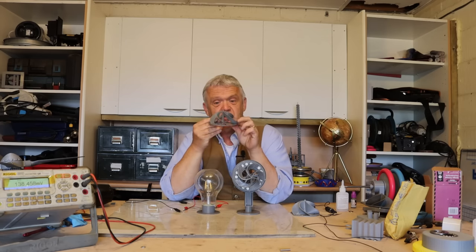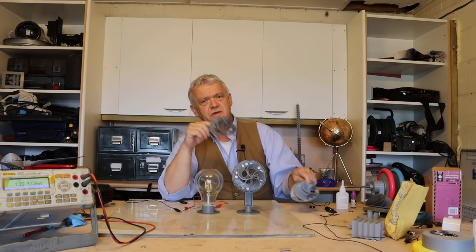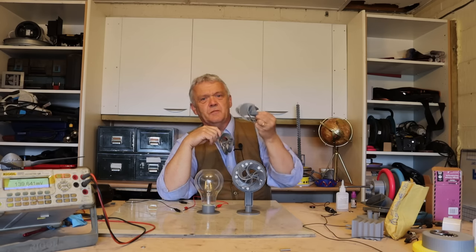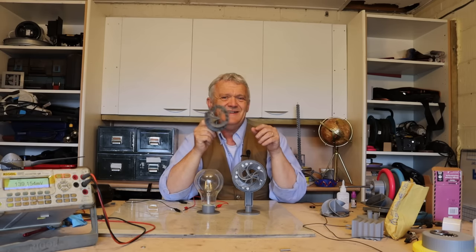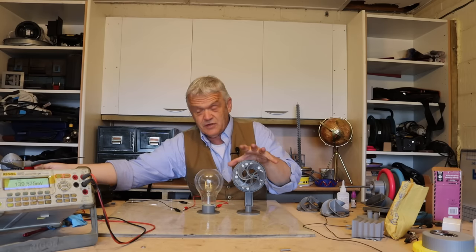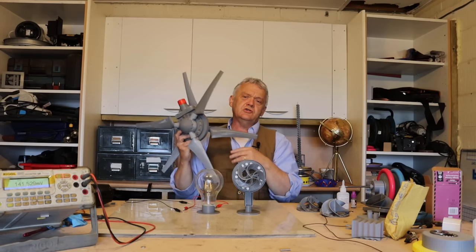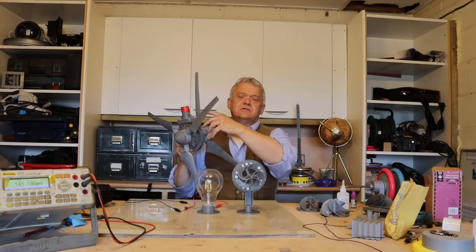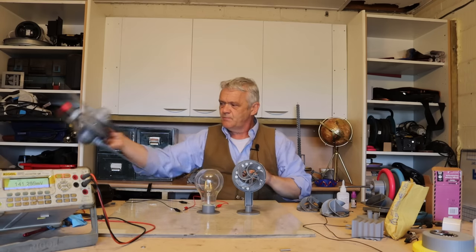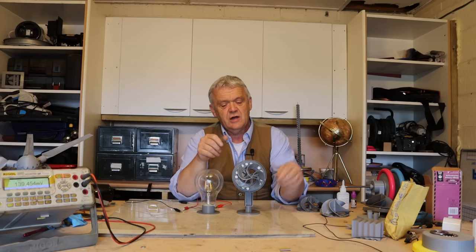What I've done is basically hollowed out the center — these are twisted blades and we've got a nice exit hole here. What we've done is change the drag type into a lift type turbine. This one can spin faster than the wind; the drag type can't because it's just being pushed by the wind. This one uses an element of lift as well as drag, so we get better performance. This is actually a dual rotor — the concept here is identical, but we're using the extra bit to drive these back. This is a hot topic in research and worth looking at some of the papers.